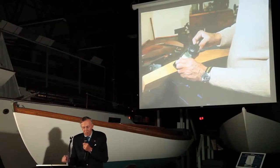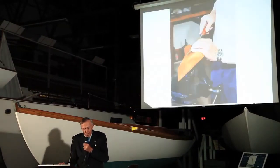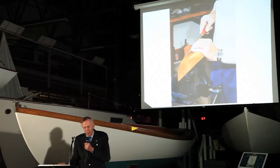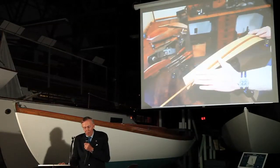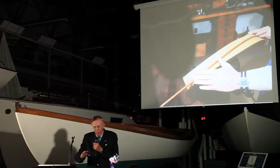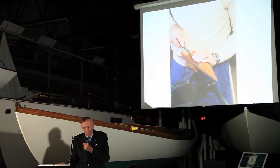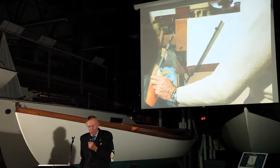Then we go to the chisels. In the case of a small model, the chisel has quite a round to it so you can work in those inner corners — the curvature on the tool matches the curvature in the model. Here the chalked batten is employed: you wrap it around the hull where it fits pretty well, then scrape it away around the surface to allow the chalk to show the high spots to be cut away, and again back with the chisel.